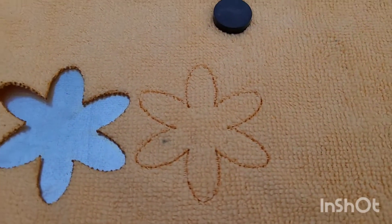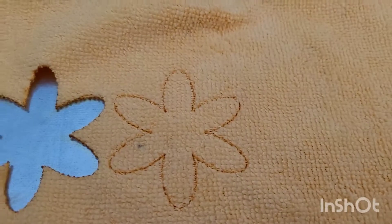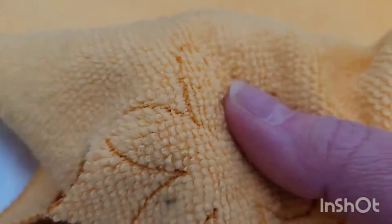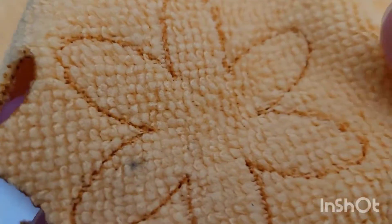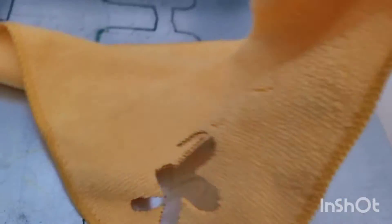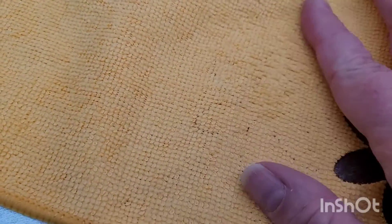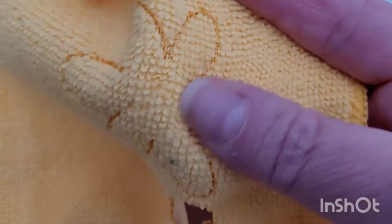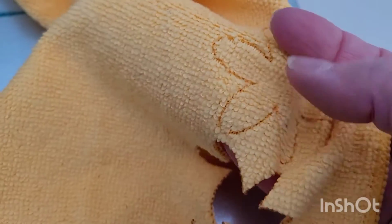Check this out — I think this would be great for just line engraving. It was 10% power, still at 300 millimeters per minute using LightBurn, cutting it as a line. You'll notice it's subtle — I like it and it does not go all the way through the fibers, it's just melting that line. On the other side you'll notice just a teeny hint of it, but I don't think that's going to fall apart and it would last through the wash.